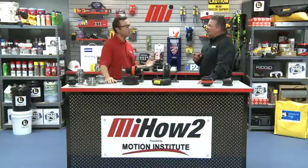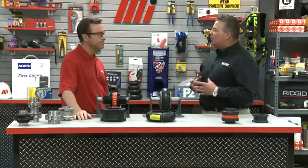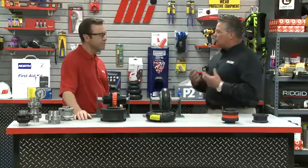Why is balancing important for pumping applications? The amount of imbalance of a coupling is directly related to the amount of vibration seen in the rest of the connected equipment in the system. Any time you provide a coupling with a high level of balance, it reduces vibration, which increases the life of the bearings, seals, and other components of the pump and motor.